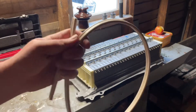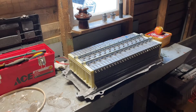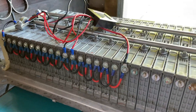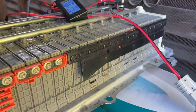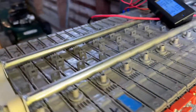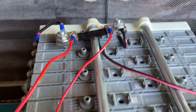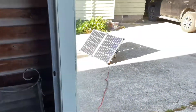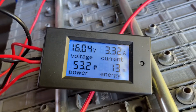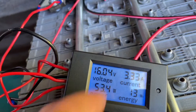This stuff is kind of expensive, but I'm only buying a meter — about five dollars. Can't imagine doing a whole house up with it. I've got most of the cells hooked up together in the 14 volt configuration. These look dirty but the other sides are clean. Got my shunt rated for 100 amps and my solar panel set up in the middle of the driveway. That tells me we're charging at a rate of 52 watts, 3 amps at 16 volts.